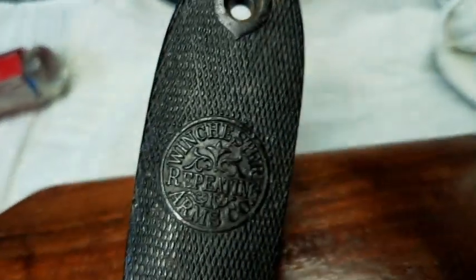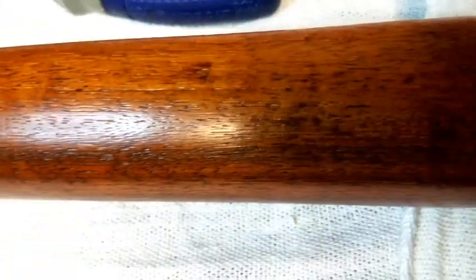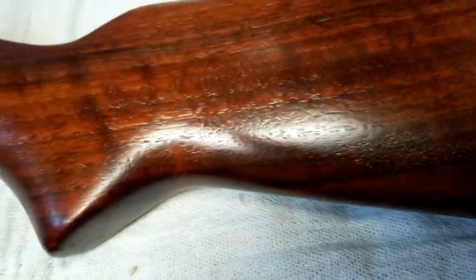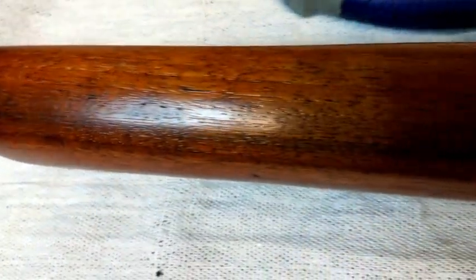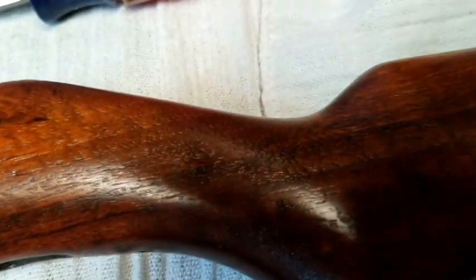Winchester Repeating Arms. So, old .22 rifle and I want to get this a nice finish. You can see there's the wood grain on there — it's not a very smooth finish. This is the finish that this thing has had since it came out of the factory. I'm going to be stripping it down. I'm not going to show all the processes — there's so many guys out there that do that and they've done it better than I could. But I'm going to be stripping it with some citrus stripper, then raise the grain of the wood with steam. I believe this is a piece of walnut, so I don't think I'll need to stain anything. I'll have to see when I get all this finish removed. Then I'm going to be applying probably six or eight coats of true oil on this so that it will look nice and smooth, hide all that grain.